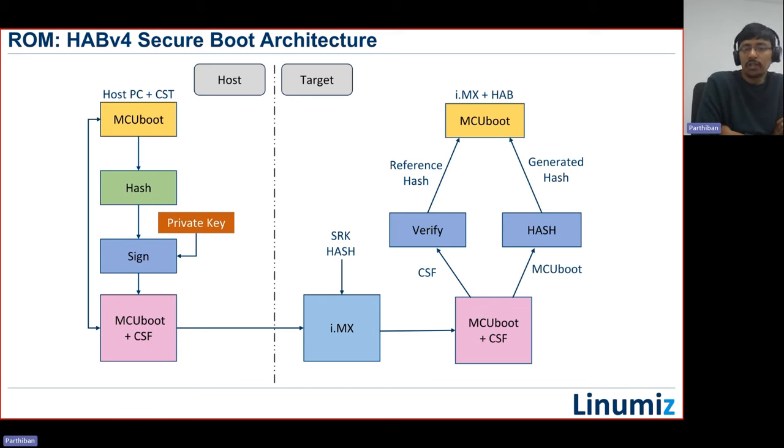This whole process during the power-up sequence — using the asymmetric cryptographic algorithm of private-public key combination from the ROM code — achieves secure booting of the first stage from ROM to MCU boot. This is very specific to the SOC you're using. If you choose an SOC from a different vendor other than NXP, you'll have different capabilities. Refer to the technical reference manual of your respective SOC to determine whether it supports secure booting or encrypted booting, then use the vendor's tools accordingly.